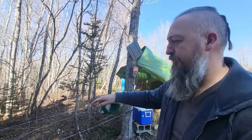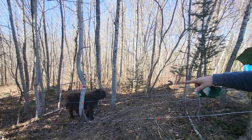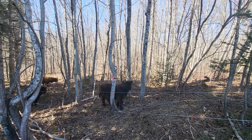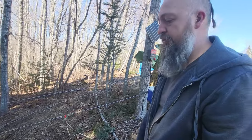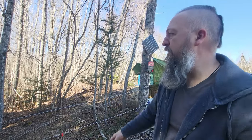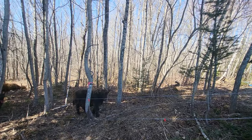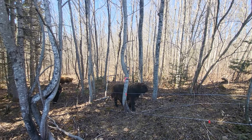And that's what actually completes the connection. So the cow or something touches the fence, the current goes to the ground and back to the grounding rod. That's what completes the circuit and gives them that shock. So if you don't have the ground in there properly, it won't work properly. But when you go onto a bigger piece, like this is maybe 1/2 acre that we've got them in right now, you go into a bigger piece and you'll need 3 grounding rods for that entire piece.